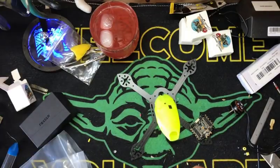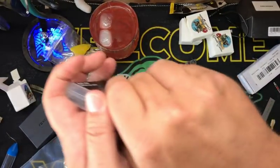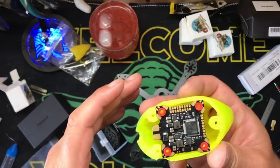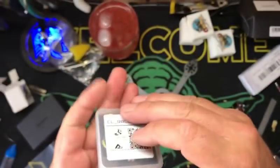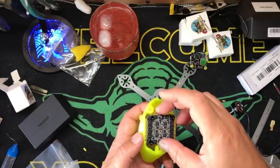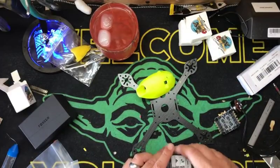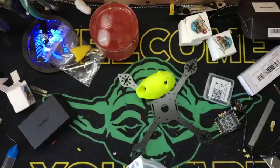I was going to use the DAL RCF flight controller that my brother Mr. Arby in Oklahoma gave me. I have tried to use this flight controller in four different builds and it just doesn't fit — it's a nice flight controller but those stupid corners don't fit anything. So we're going to go with the old faithful CL Racing F4 OSD, and that fits just fine. The ESC may be a tight fit with the canopy. The frame came with a taco strap, battery plate — which I'll throw away — and bolts for the canopy.